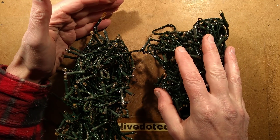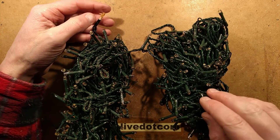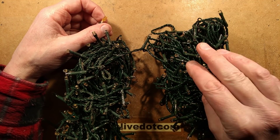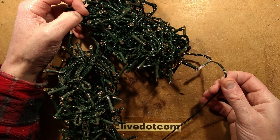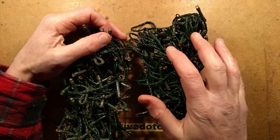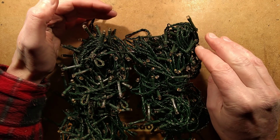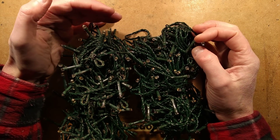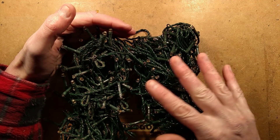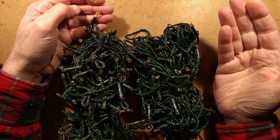If I turn them on now, running them from the bench power supply, only half will light up because the wiring uses alternate parallel circuits. To make them flash back and forth it changes the polarity on just the two wires feeding the string. That means the polarity is changing, so effectively they don't see continuous DC across the LEDs — even when lit statically, it's alternating polarity really quickly, making them shimmer at very high speed, so it appears that both channels are lit.